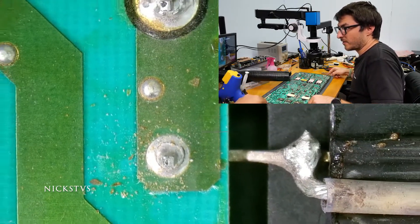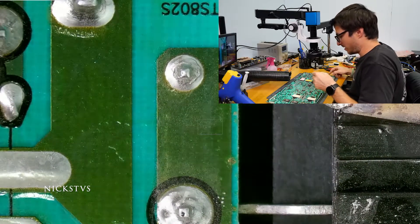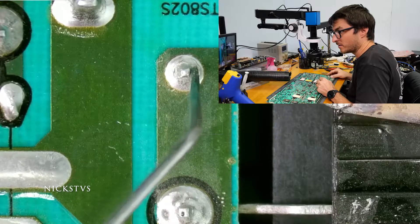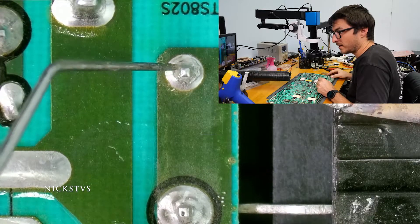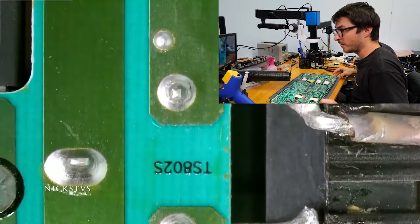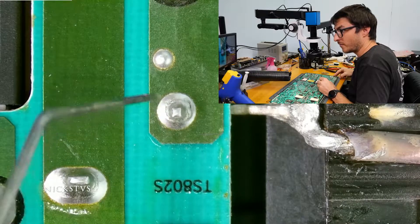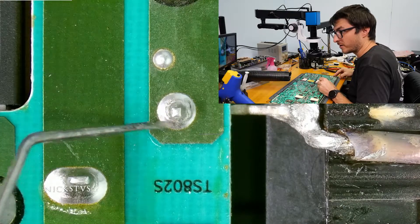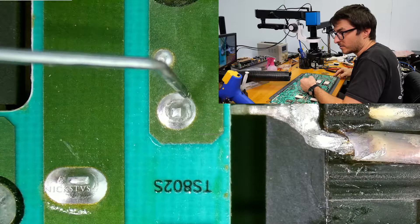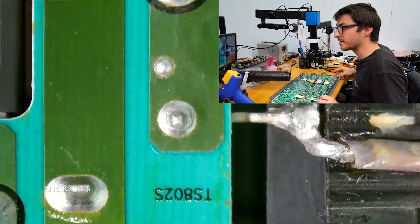Let's look at some of the other pins. That one looks okay, that one looks okay. This one doesn't look quite good — it has a little bit of a crack around here. It's not as bad as the other one; if I push on it it's still locked in, but this one's going to fail pretty soon if we don't touch it up, so we're definitely going to want to add solder to that one as well. Same with this one over here — it's not moving, but again we can see there are beginnings of a crack, and it's still making good contact but we definitely need to add some solder.